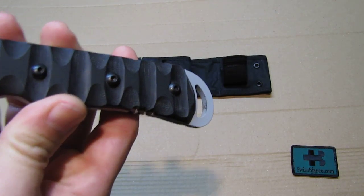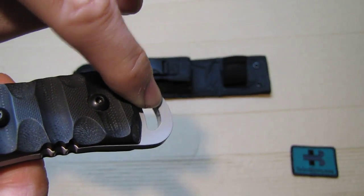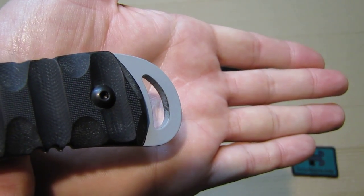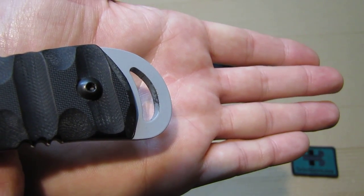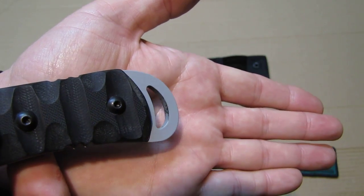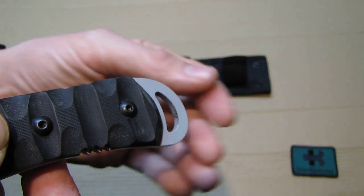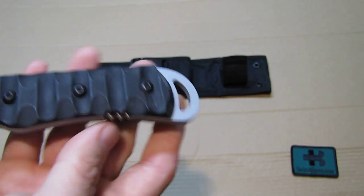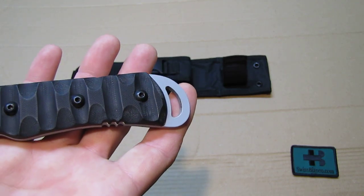One drawback is, in here they did hang it and then they did powder coat it, and we see where it did hang there the coating did not reach 100% and left the carbon steel that they use for this knife uncoated. So this knife is not stainless steel, it will rust on the edge and in here if not treated well. So this part in here I'm going to coat again a bit, that's easy.